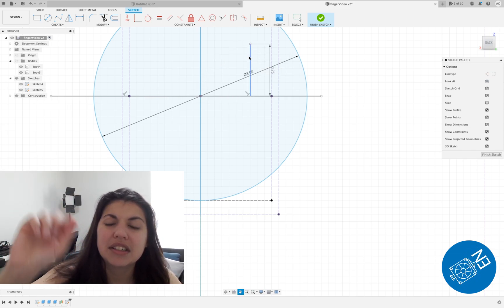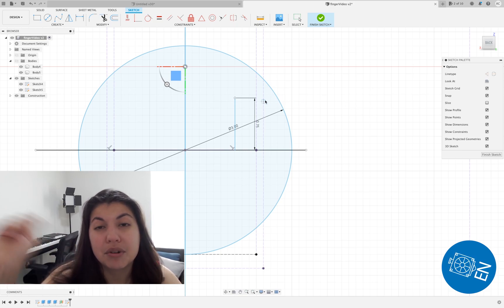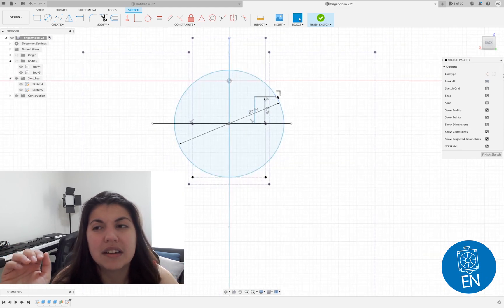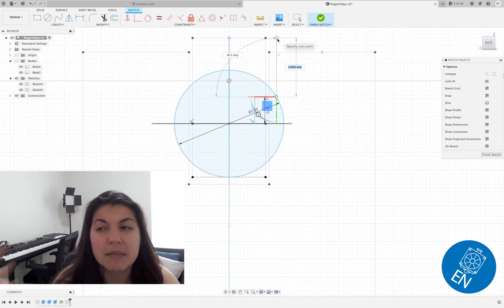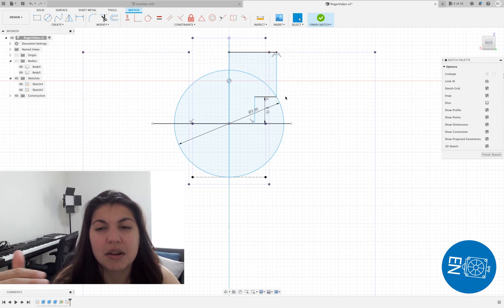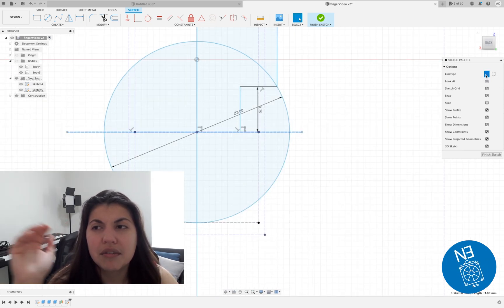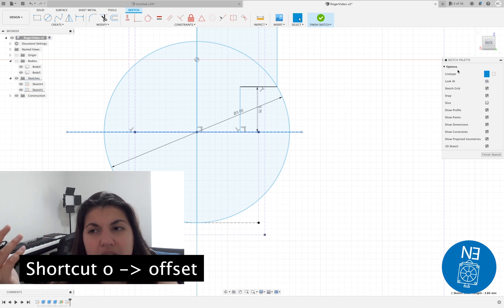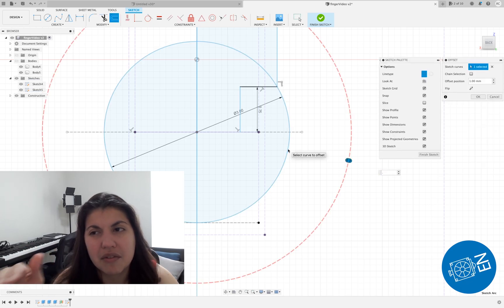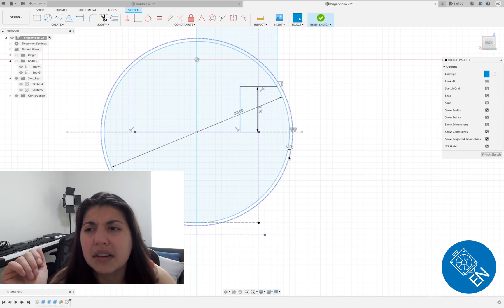That's where it gets tricky and it kind of depends on the printer. I used a one-fourth rule — whatever the diameter of the circle is, I made the revolve line one-fourth of that diameter, and that's where I'd start drawing the line I would use to revolve and extrude around. Most people I saw did it around the one-fourth size of the sphere.